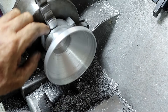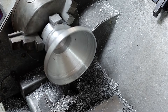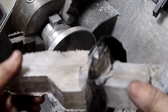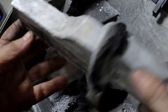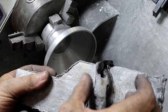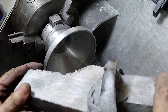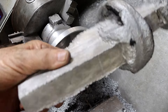It's lunch time now - I'm going to get that out of there. I won't be able to finish it entirely until I get it into the rotary table, finish milling the outside off, mill this bit up and drill a hole through it. But I've had plenty of time to think - this is the back end where the motor bolts on. I reckon I can resurrect this back up to about here, and then there's just a short piece on the front where the grinder mounts, so I might just use this piece for that.